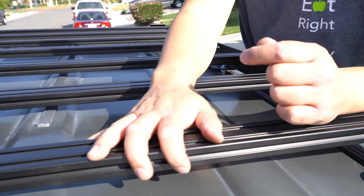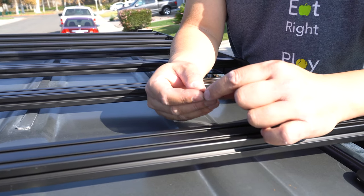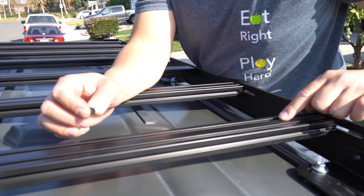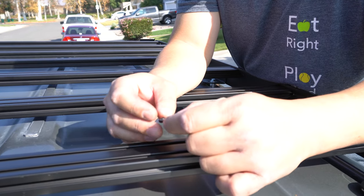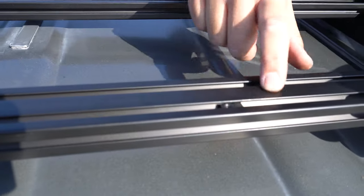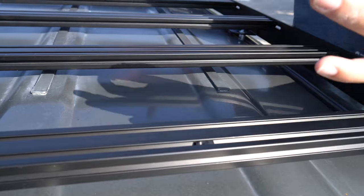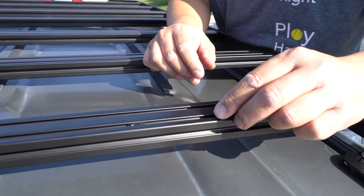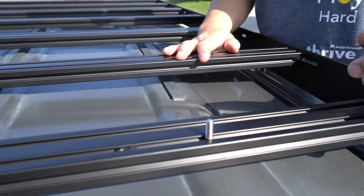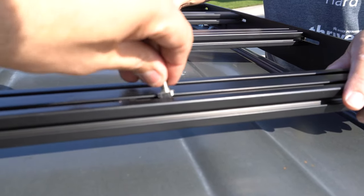The beautiful thing about using extrusions — a lot of companies use them for good reason — is the modular design and being able to mount all kinds of stuff because there's huge support for it. Some companies notch out areas and use regular washers or nuts. You can use these drop-in T-nuts: they go in, turn, and lock themselves. You can mount anything to that. The other option is a quarter-turn lock — you just turn it and it locks on itself, won't turn anymore, and then you tighten whatever to it. You can pretty much mount anything you can imagine to this. Super easy.